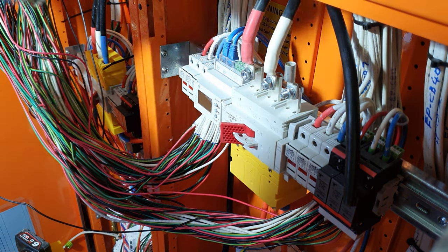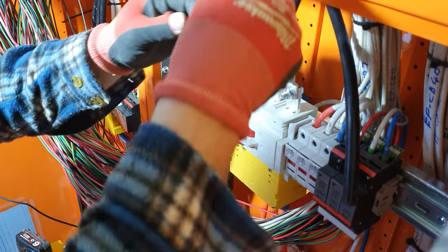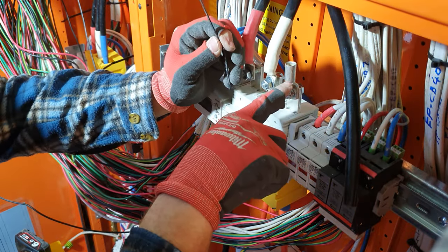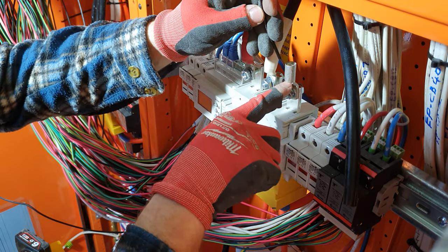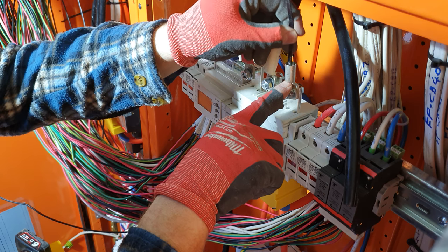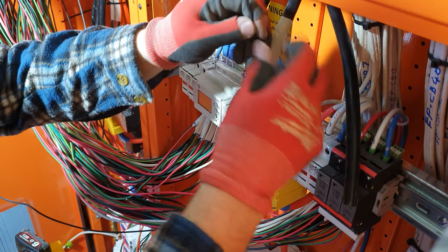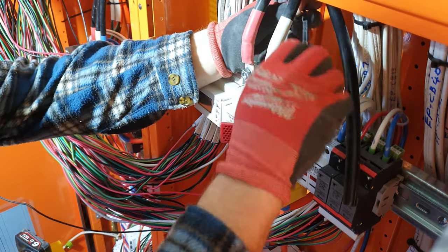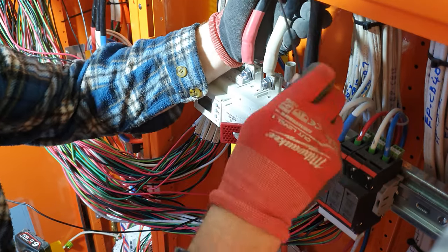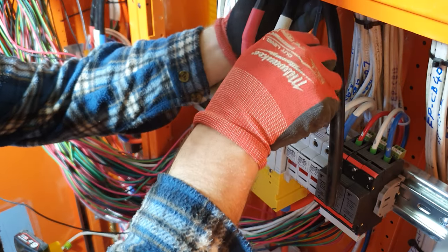So now the tip is — he uses a cable tie. You can use a cable tie or a piece of cable. The bottom of the lug here is this point where my fingernail is. That's where the tip of the cable can go, because it can't actually go any further down because of the lug coming back up. So what you do is you use a cable tie as a measuring device to get the length of your cable.